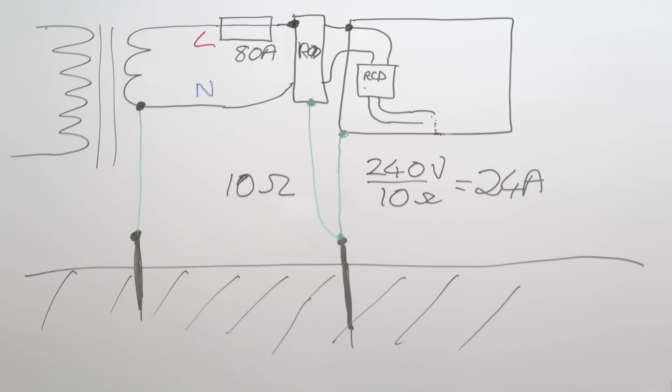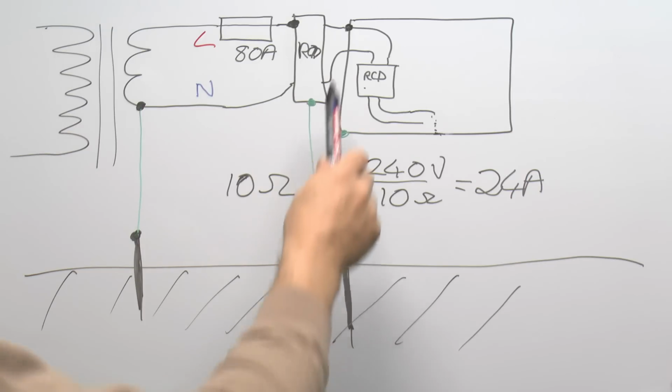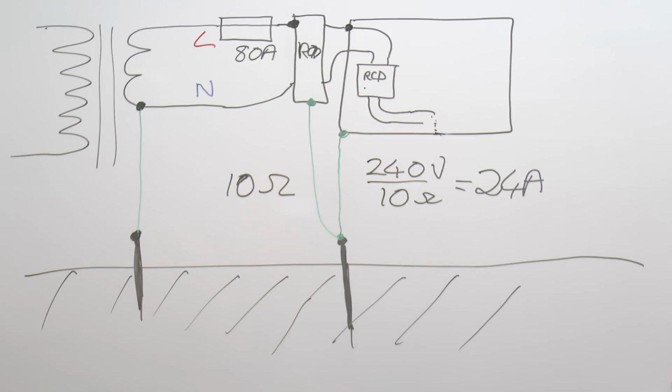Now, one other possibility is to have a plastic consumer unit, but then place it inside a cupboard or something made out of non-combustible materials. Unfortunately, the choices of non-combustible materials for making cupboards will probably come down to metal, and then once again you've got to have a hole in the side of the metal cupboard where the cables can come in, and that's the same problem as before, so no help there. In theory you could have the wires coming in through the wall, for example, surrounded by masonry or cement, and then coming into the back of the cupboard and have a sort of metal front on it, but really this is going into the realms of fantasy, and a considerable amount of construction work will be needed just to avoid a problem occurring like this.